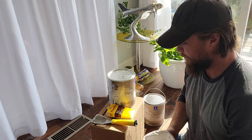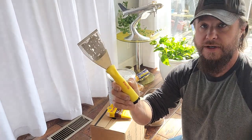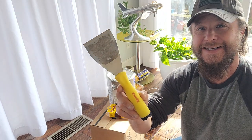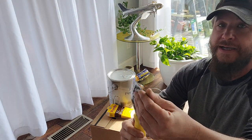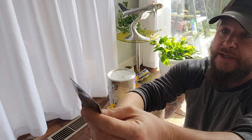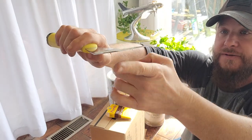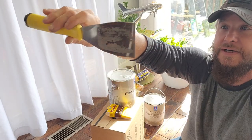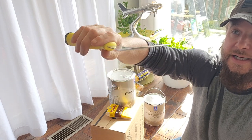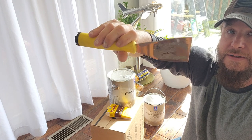I've got a Purdy scraper — and I don't mean purdy as in 'you sure got a purdy mouth.' I mean Purdy, P-U-R-D-Y, the brand. I'll put a link in the description for this. You can do damage with this, so make sure — one side has the bevel, the other side is flat. Put the flat side down, bevel goes up. That's how it works. Don't put that bevel down and start digging in. Use the tool at the angle it's supposed to be used at.